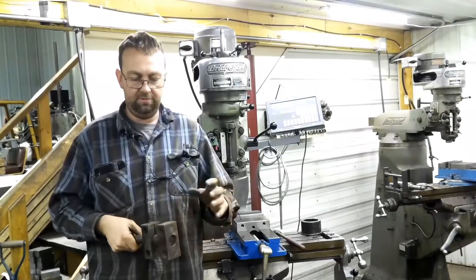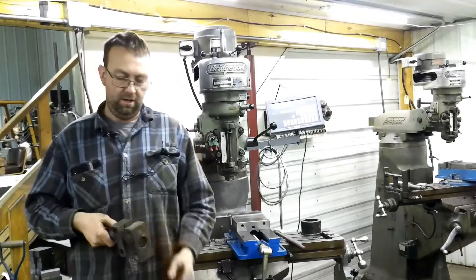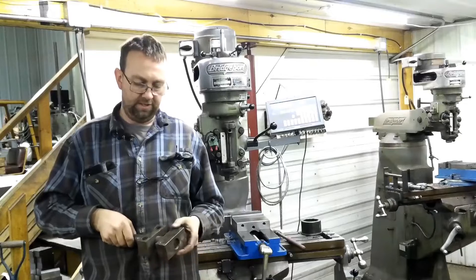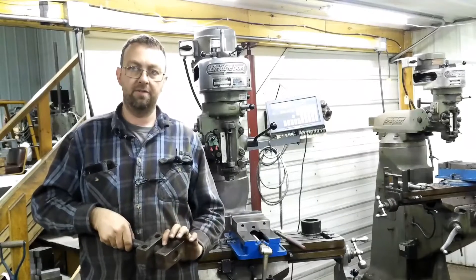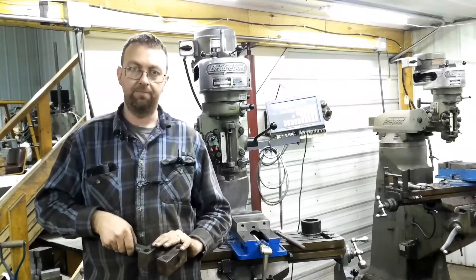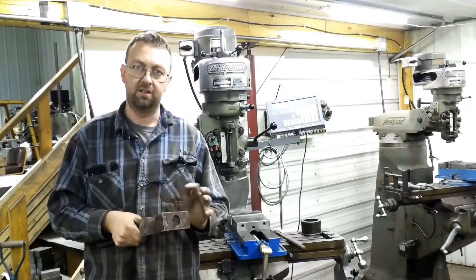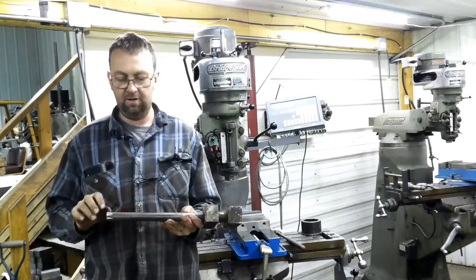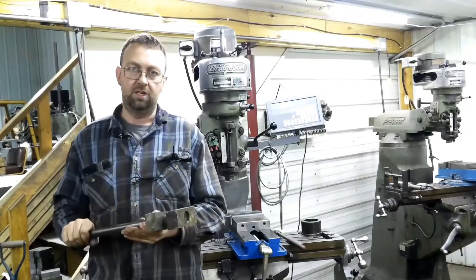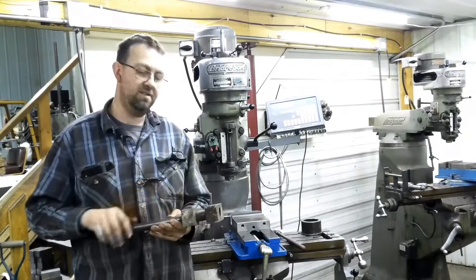What we're going to do is drill these blocks in the bridge part here, and then take them over to the radial drill. I've got taps and a tap driver that fits in the radial drill beautifully, so we'll just tap them in the radial, and then we'll single point thread these on the lathe. I already got the basic shape turned out, so we'll get this up, get the blocks in the middle here and get started.